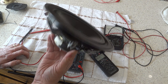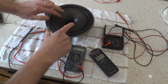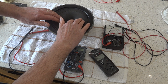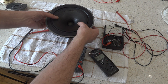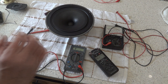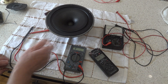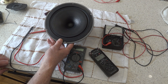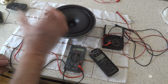Now it doesn't mean it's working brilliantly — it could still have a fault. The cone could be rubbing inside. So what I'm going to do is just push up and down on the cone on both sides — that feels okay, can't hear any scratching or anything like that. That's maybe another telltale sign: when you push the cone in and out, if you can hear some rubbing or scratching, then maybe the cone isn't lined up properly and it's on its way out. But if it's moving nice and freely with no sound, that should be okay.